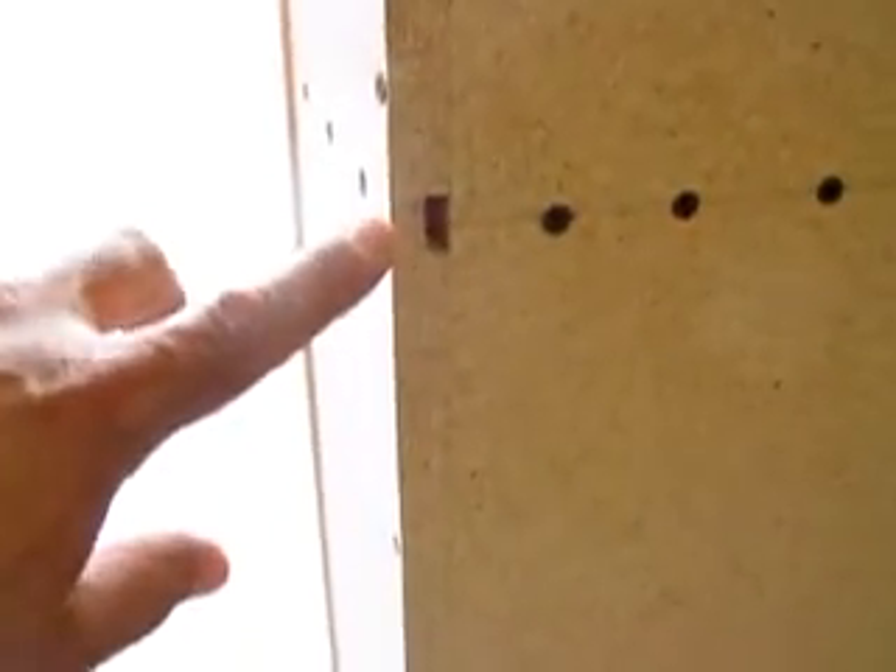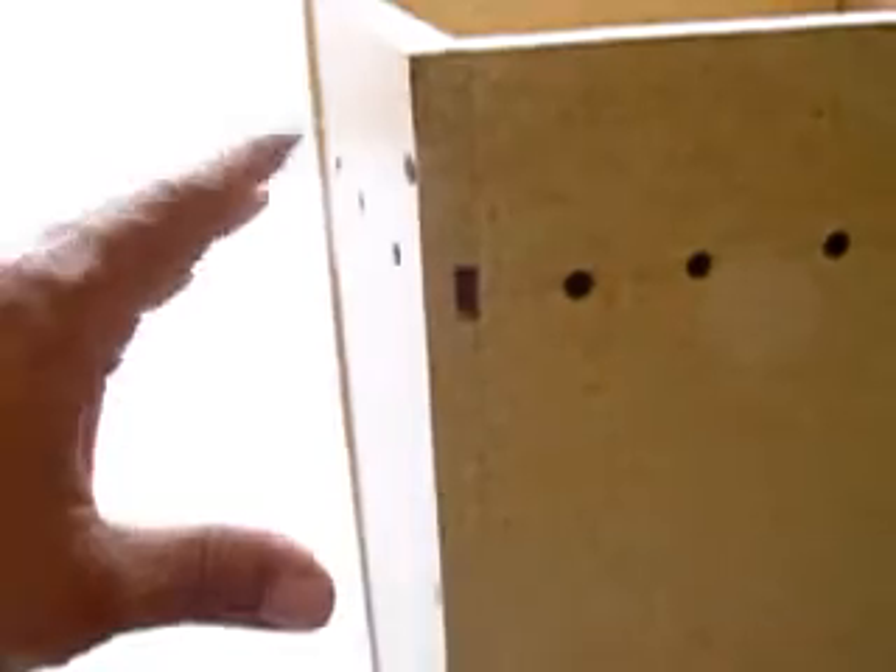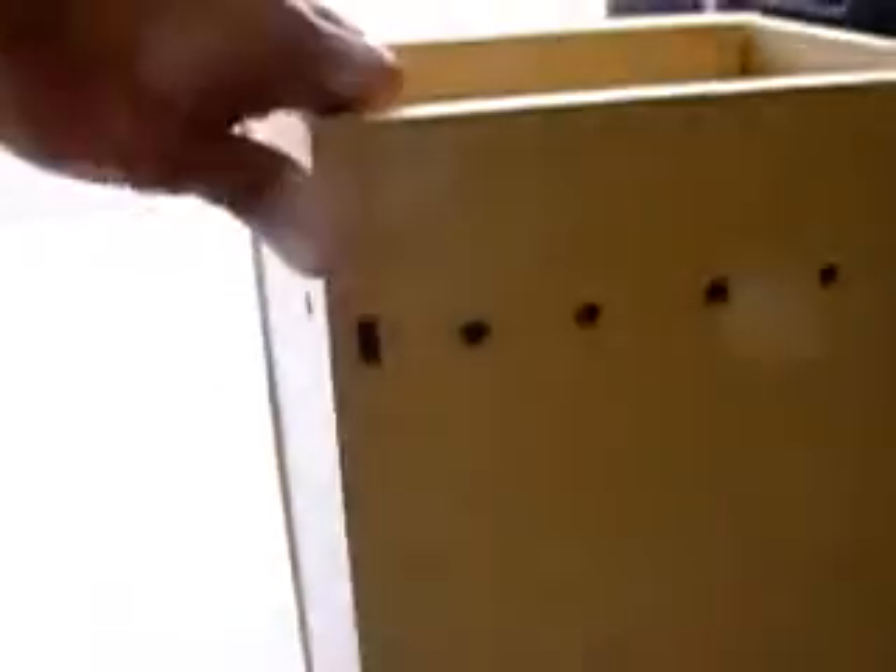You don't see the cleats because this style has a back, but the back is just aesthetic. Let me show you a clip of our cabinet. It has a back that's 5/8-inch thick, which is integral to the design and strength of the cabinet, because the side is screwed all the way down the length of the back, and the shelves are dadoed into the side like you see here. That way the shelf is reinforced, strong, and sturdy — so you can get an idea of what the differences are.